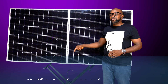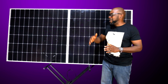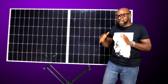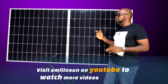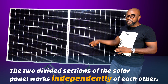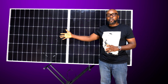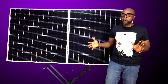This is essentially done to address the issue of shading, which has been plaguing the solar panel for years. Situations where you have particular cells blocked off when you have leaves overhead — what it potentially does is drag down the entire output that is connected. But what they've done is made the two sections of the solar panel work independent of each other. So in situations where some cells are blocked away from sunlight, it no longer affects the entire output. Because they work independent of each other, this half works alone and the other half works alone, so it no longer affects overall production.